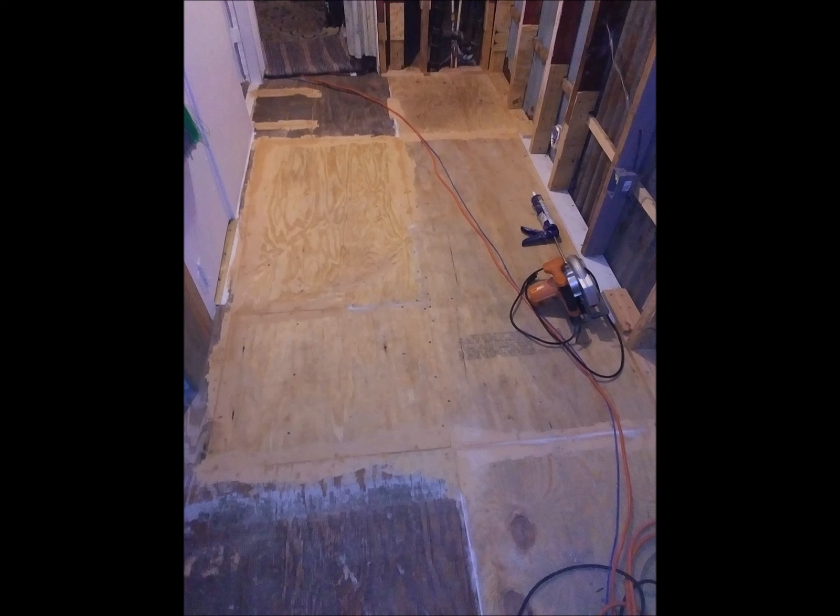Here is where I have put in wood filler in all of the little expansion gaps around the subfloor I installed, all of the pieces, just to even it out and sand it down — just to get rid of any gaps or air gaps coming up through, and level it out and smooth it out for our vinyl sheet flooring.